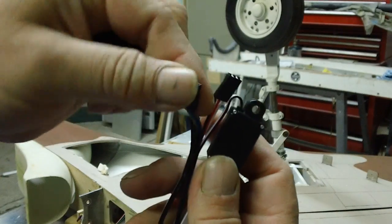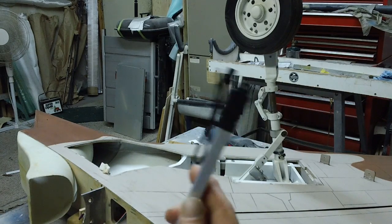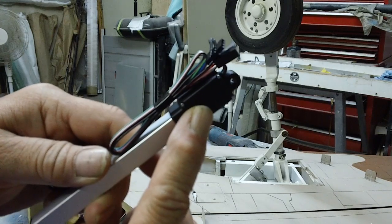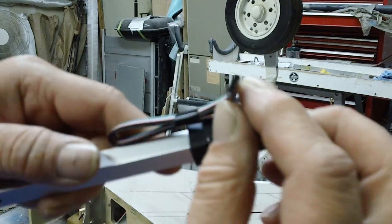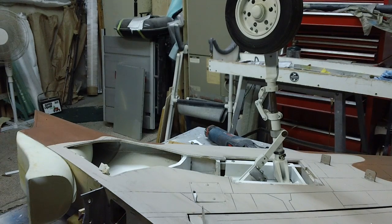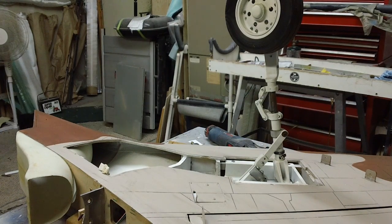This one has both plugs — it's for RC or computer operation. That's the computer cord and that's the RC cord. Joe actually ordered a 12-volt because they're geared different. They have a lower stall current because of the gear ratio. These are 250-to-1, and the 12-volt ones are 100-to-1, so they're going to move twice as fast. But the deal is they ain't going to make them for RC for a couple months — they will be putting them out later, but not right now. Then all you'll have to do is patch in another battery to this cord, and we can get them quicker and make them go up and down a little quicker. Just make a separate little LiPo pack. But they don't make them as of right now — all they make is these 6-volt ones. And they work good; it just takes a couple seconds for them to come up.